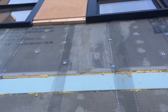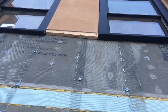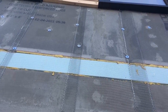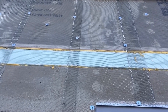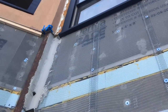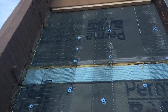And you can see up here, we put another drip cap along the edge of that foam board that they had up before. So that's gonna create a nice transition between that upper section and the new parging below. And that drip edge is gonna help shed the water out over that, so we avoid that problem that we had before where the water was getting in, infiltrating behind that foam backing, rusting out the old wire mesh and popping that original parging off of the wall. So hopefully that drip edge does the trick and sheds the water out over the parging and everything drains right.